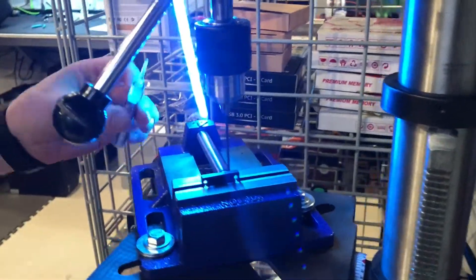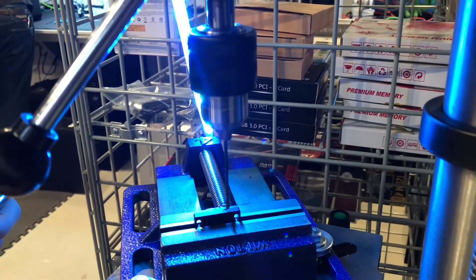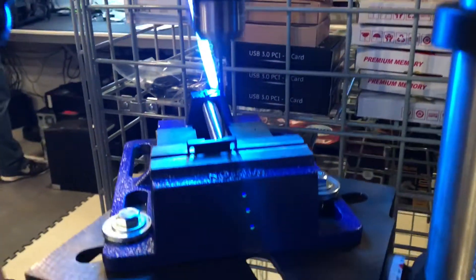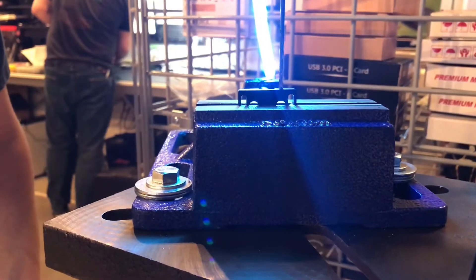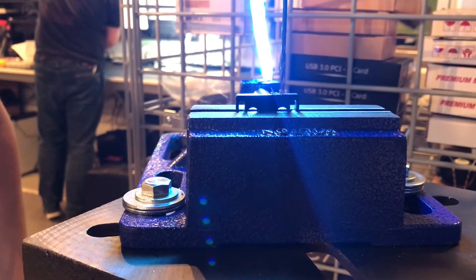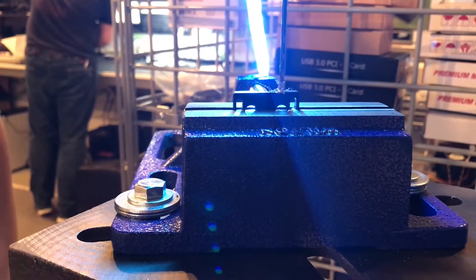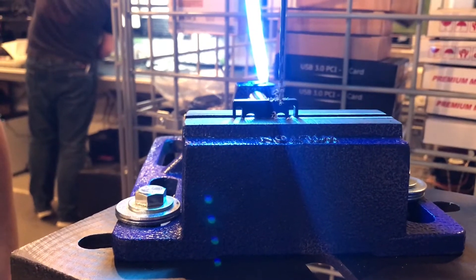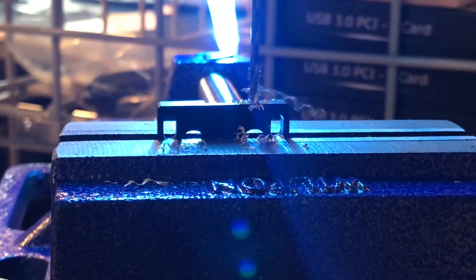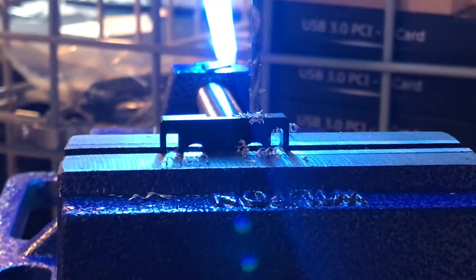You do want to use some kind of lubricant — we just use Super Lube, works really well. The big thing is you want to go slow; make sure your drill press is running at a low speed. Start nice and slow and give it plenty of time — don't rush it. The benefit of drilling on the opposite side from the stock position is that the stock holes are a lot thinner, so on the side they originally drilled, the hole is offset and thinner. On this side we're going to get a lot more thread engagement.